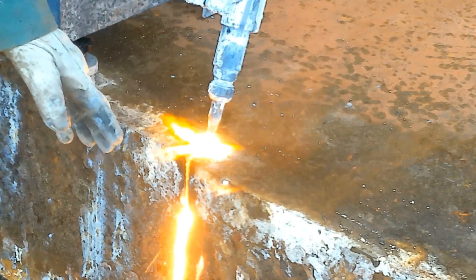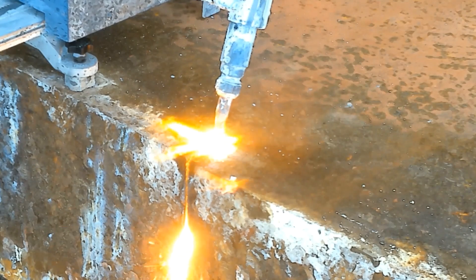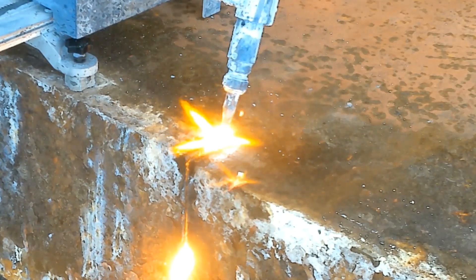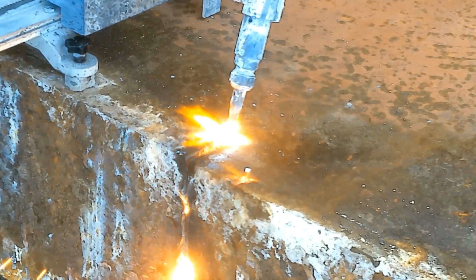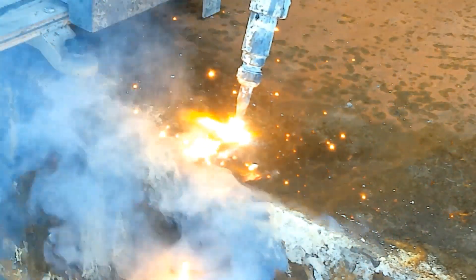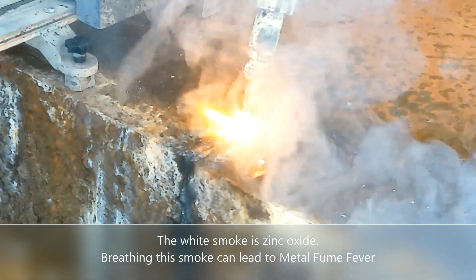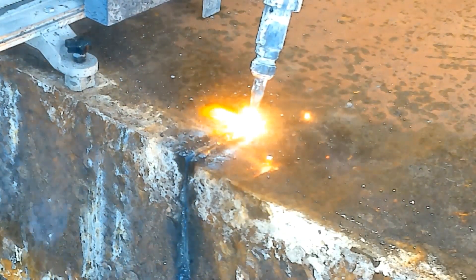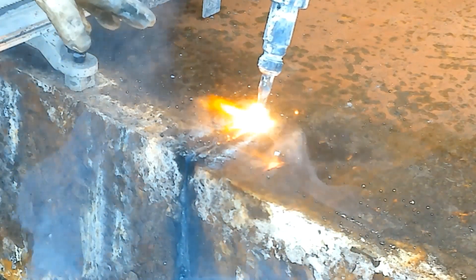Right now I'm cutting through the entire kettle wall, so it's not just two inches I'm cutting through — probably about four to six inches. As soon as I pass the kettle wall I'm going to speed this up just a little bit. Now I'm through the bottom of the kettle and you can see I'm hitting some of that zinc. It's kind of kicking back — that's why we have that tip angled — and you can see all the zinc smoke coming up, that's why I'm wearing the respirator. I do not want to get sick tonight. So I'm going to speed this up just a little bit, up to 12. So far we don't have any zinc right below the cut, but usually at the far end is where I'm going to run into a lot of zinc that wasn't able to fall down.